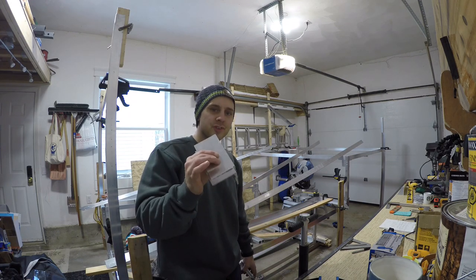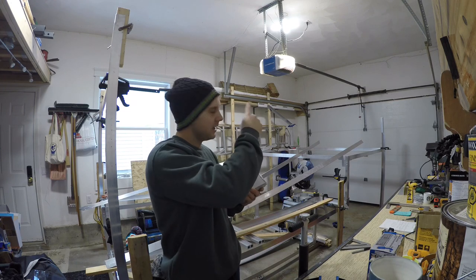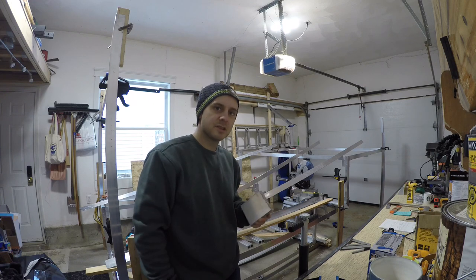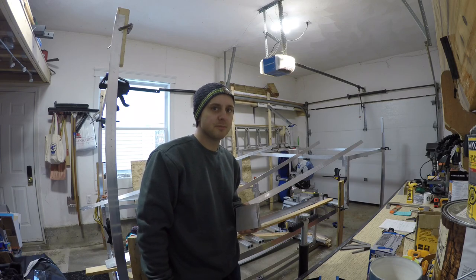But I got my corners for the rear, and I cut these flat plates to go on the brackets where the angles go on the front. So we'll put them up, trace them, cut them to size, rivet them in, and then once the weld's on, they should be good and strong. So now we'll put the top on and that'll just about tie things up.